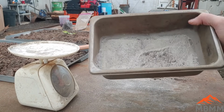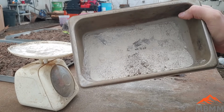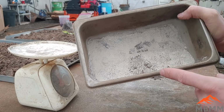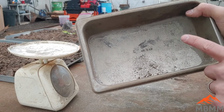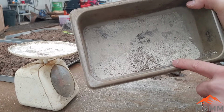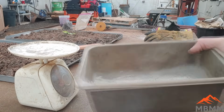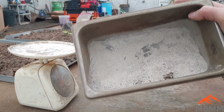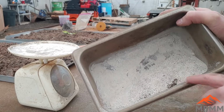Okay, so there's our charge. I'm going to get that in a crucible. I'm going to add a bunch of iron nails to it for an iron source. The nails are going to take any copper sulfide or lead sulfide or any other base metal sulfide that we make, and hopefully reduce them back to copper or lead, and create iron sulfide. You can see how that works using the metal reactivity series. The idea is that we're going to have a metal alloy that's mostly copper with a little bit of tin and gold and lead, and the iron sulfide that we make will be absorbed by our basic slag, which is mostly soda ash.